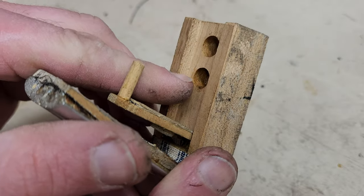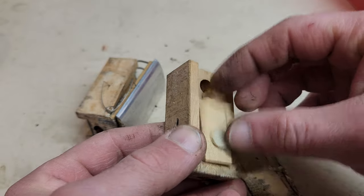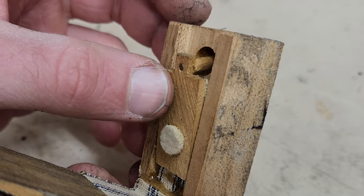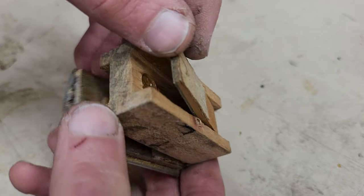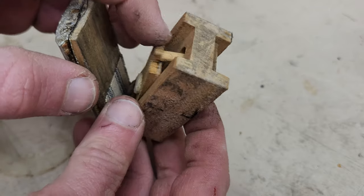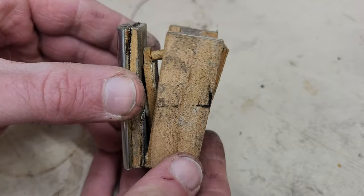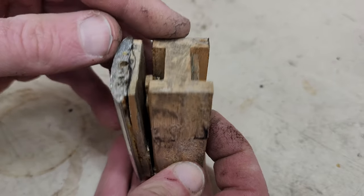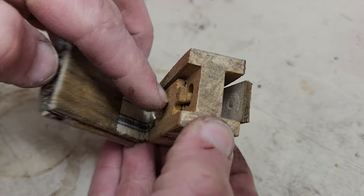There's two holes here. This bottom one connects to the supply, and this one vents to atmosphere. This valve can shut off the supply, and this outside valve can vent it. So with this outside valve closed, the inside valve has to open. The pneumatic will begin to collapse. And as it does that, it opens that outside valve and closes the inside.